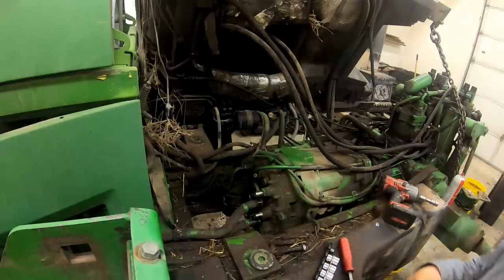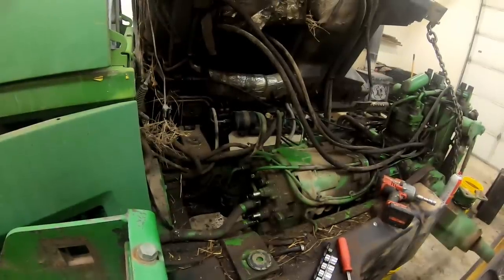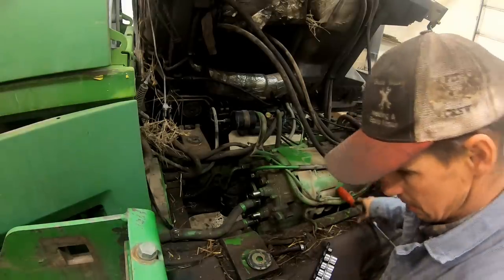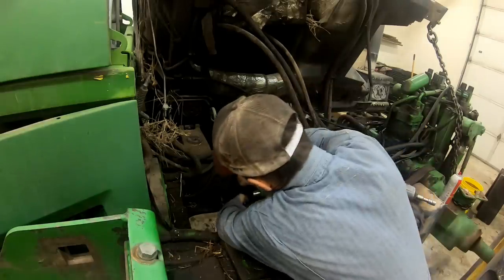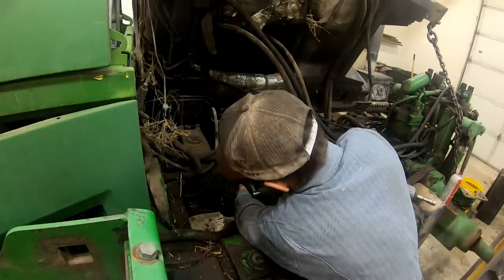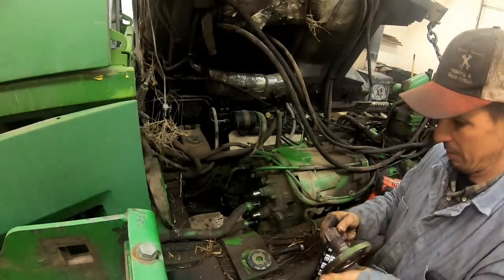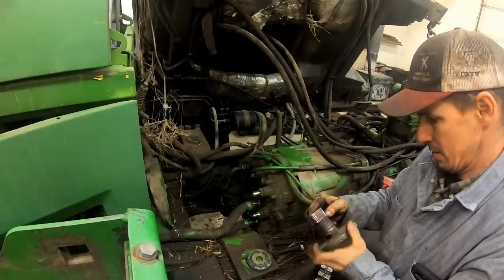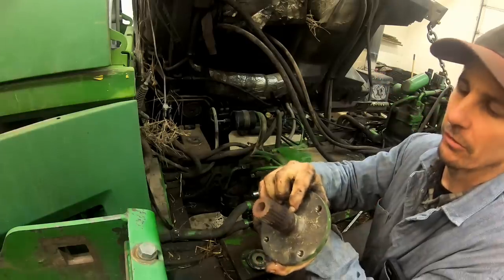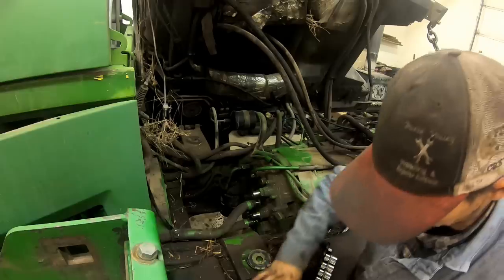Hey, there, finally came out of there. Feel good in it. Well, what you can do is just, if you want, sometimes just take the flange and just pop that out of there. That's just splined in there. Sometimes these will get quite a bit of wear on them too, but this one don't look bad at all. But if the seal ride gets a groove worn in it right here, just replace it and change it out.